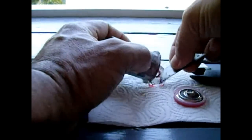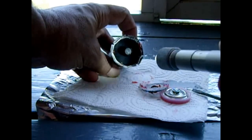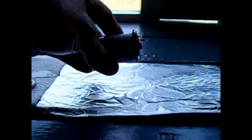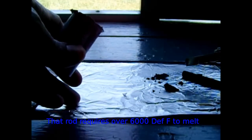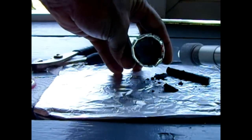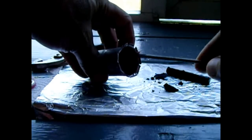It should be packed with powder — that's the electrolyte packed in around the edge. We're going to scrape that out with a screwdriver, all of it. Before we do that, let's grab the post in the middle, twist it and pull it out. That's the carbon right there — I'm going to probably save that.